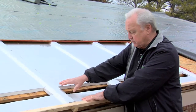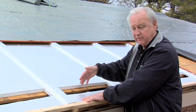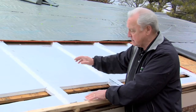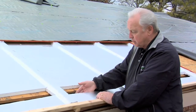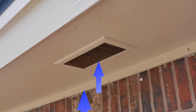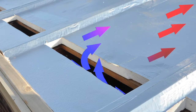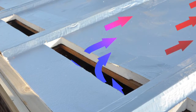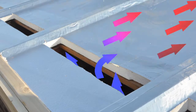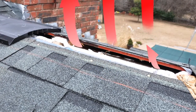At the bottom here you'll notice we've cut a hole so that we can draw cool air from the soffit — because as this warm air is rising, something has to replace it. We're going to pull the cool air in from the soffit area, which is the coolest area we have. It's going to be about 5 to 10 degrees cooler underneath the soffit than the ambient temperature outside. So we're drawing the cool air in here and the heated air is actually pulling it along and expelling it out the ridge.